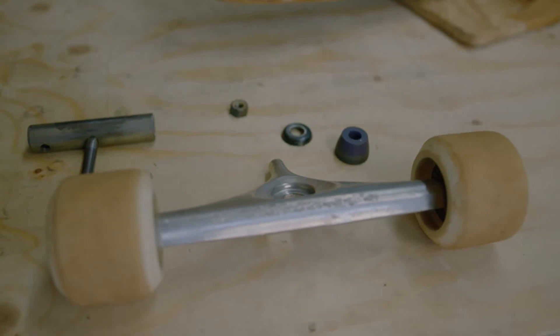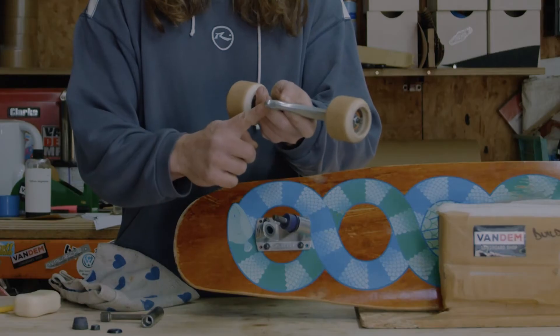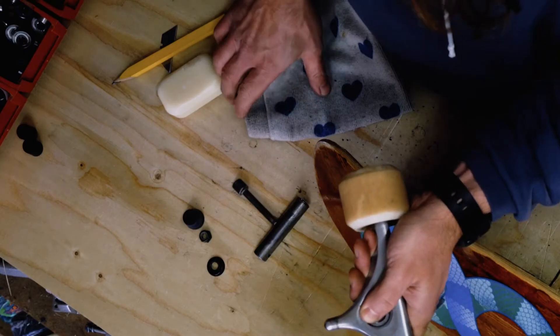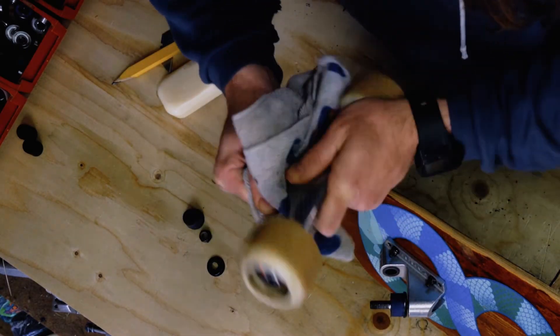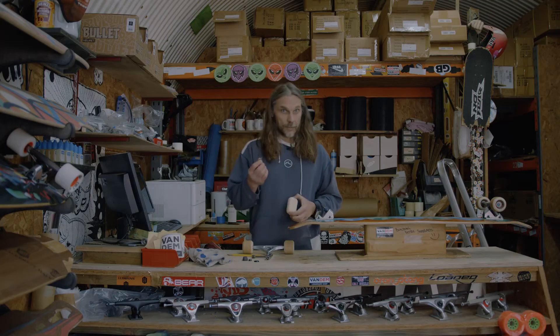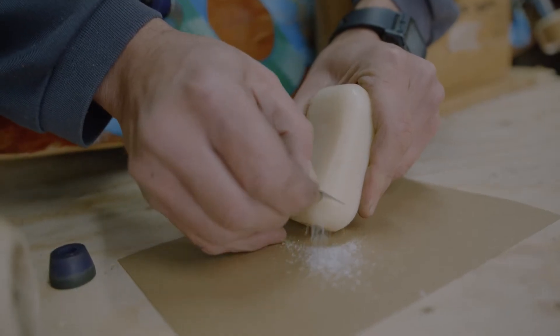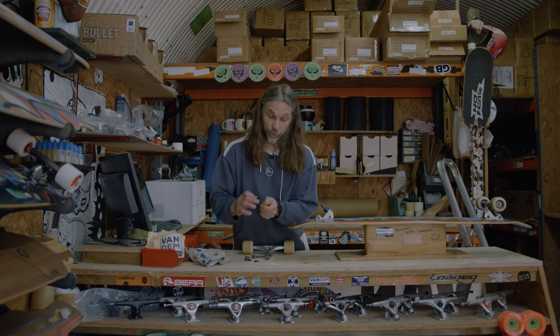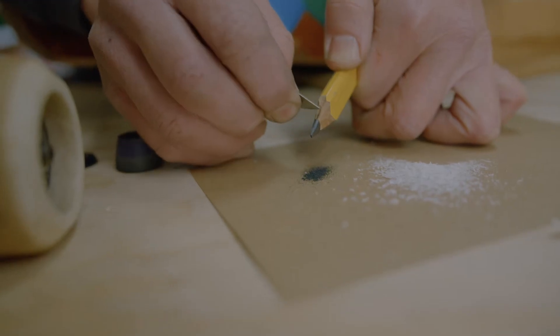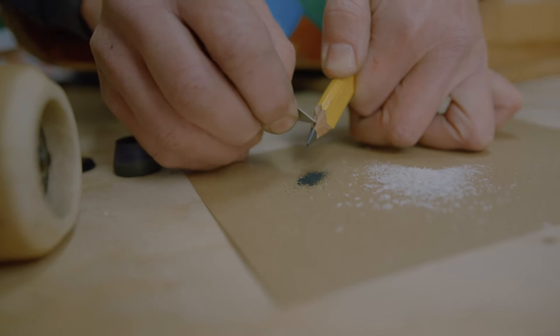So what I'm gonna do: take my pivot, which is probably where a lot of the noise is coming from. I'm just gonna give it a bit of a wipe, a bit of a clean, make sure everything is as it should be. This is where the Stanley blade comes in — just putting some soap shavings. My personal preference is soap shavings. Likewise with a pencil, same again — you want to use the graphite. Just scrape a few bits off of that.